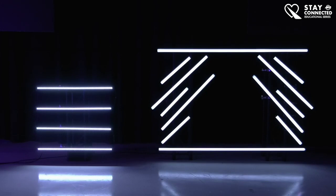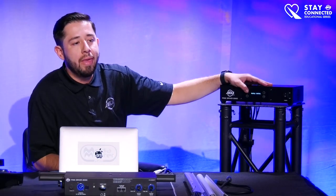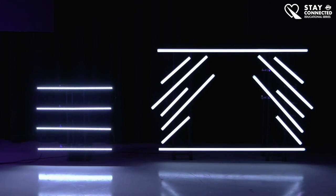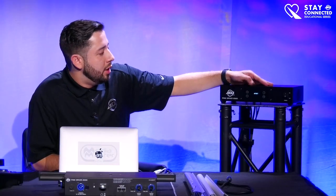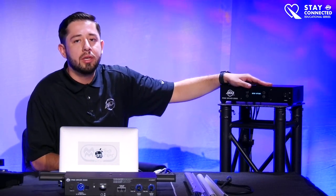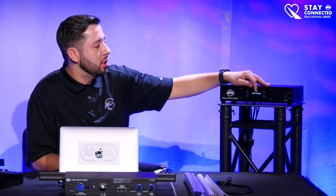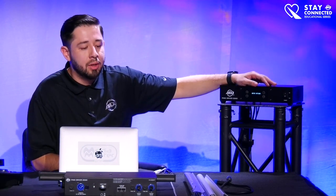Now under manual mode, you can just get a standard solid output color of white, which just lets you know that, hey, everything that is connected is getting a connection so far and is being fed power. In the case that one of the units was dead or the cable was bad, you would then see, of course, nothing. The unit would just stay black itself. Another mode that you have in here is Kling-Net, like we discussed. You also have streaming ACN, and then you have ArtNet as well. And last and final, I think it's a settings option, which lets you run through the overall settings of the Pixel driver itself, as far as what the brightness of the OLED display is, and a few other things within the breakdown of the unit. So that's that there.